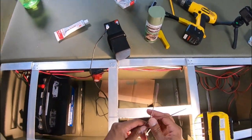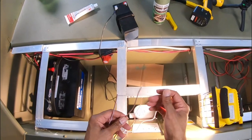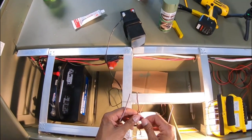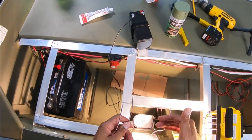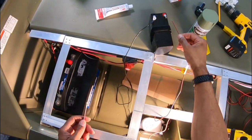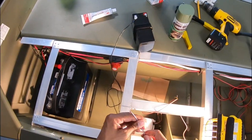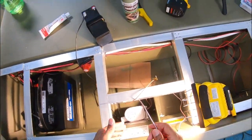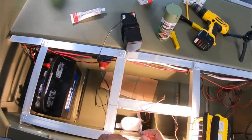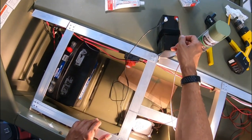This battery here is actually the trolling motor battery — a simple 12-volt battery from Bass Pro Shop. I've been using it to test the LED lights and we're going to use it to test the bilge pump too. You just have to read the manual on your pump to see which wire does what. In this case the solid brown wire with no stripe will receive power straight to the pump and activate it right away — this is what I'll put on the switch panel. Touching power to it and the bilge pump turns on.